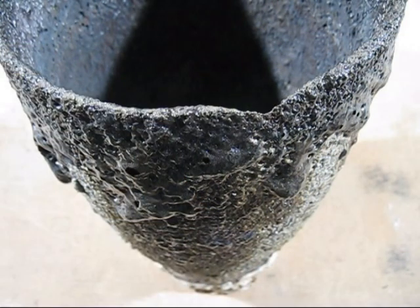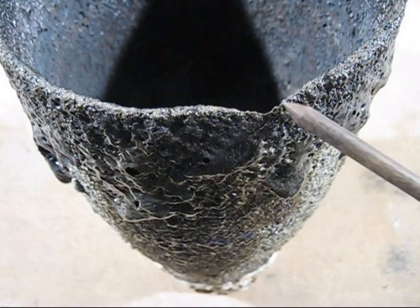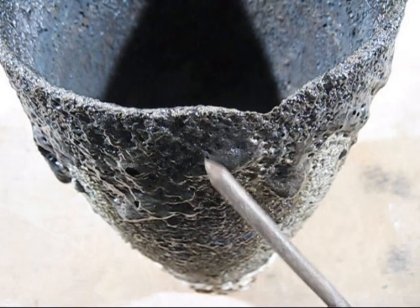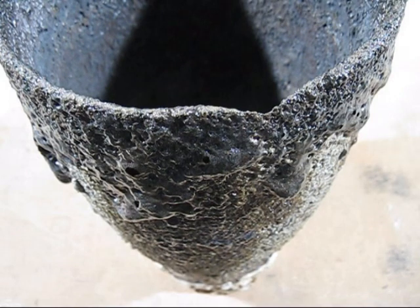With this crucible I would like to extend the life of it a little bit more. It's had 25 melts and what I'm going to do will probably last about 30, maybe 32 melts. The problem is you see that edge there — that is razor sharp. The flame will attack that and what will happen is it will get larger and larger and make a huge cutout like that. I'll show you how I fix that up.